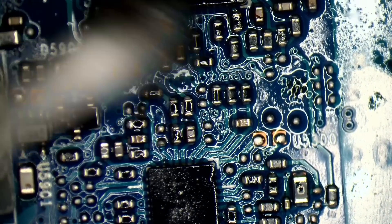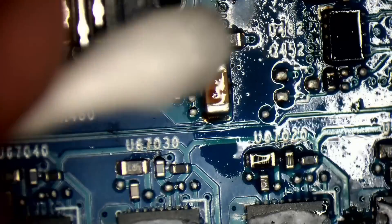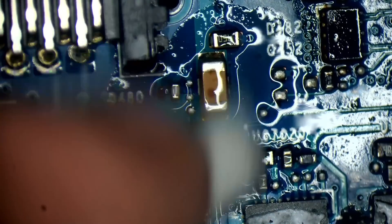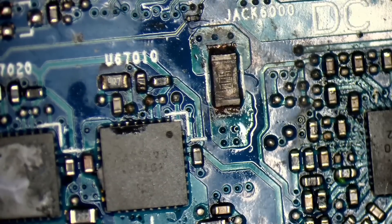That component has taken a pretty bad hit — I may need to get a schematic. This is going to be our main issue right here. It looks like we have some damaged pads, so this component is going to have to come off, same as that MOSFET next to it. We've also got some pads here that are test points — I'm going to have to re-tin those just to prevent any further damage. There's also an ON Semiconductor power management IC here. Let me clean this up first with isopropyl alcohol and a cotton swab to neutralize the liquid damage.